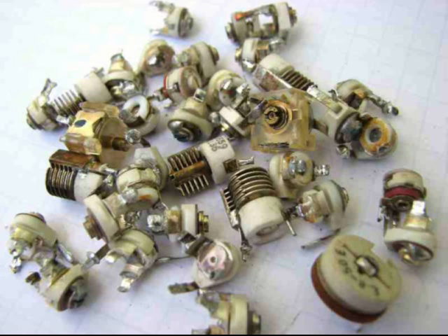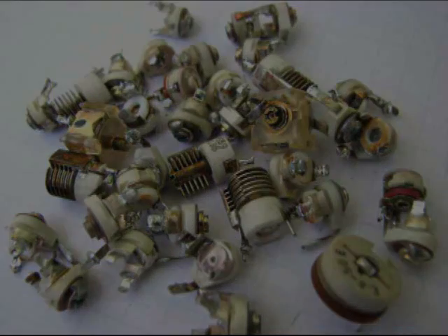One of the more profitable parts of this venture was all of the air and mica trimmers that I got off of all the sub-assemblies of the VHF radios. This is a pretty nice handful of trimmer caps. A lot of these would be good for VFO set caps or for coupling caps on coupled resonator filters down at HF.